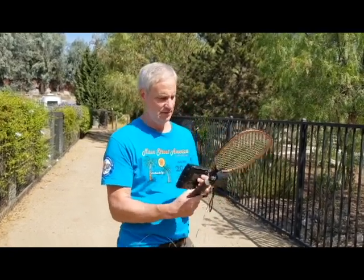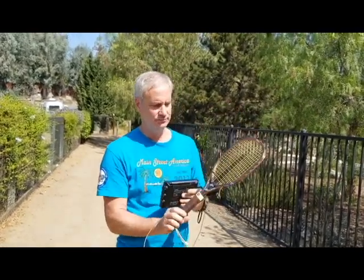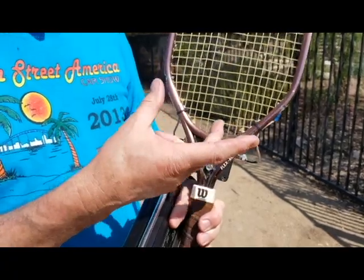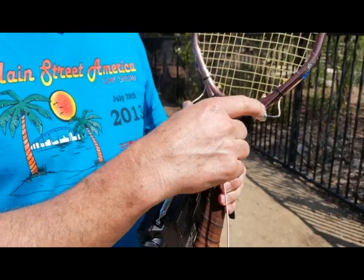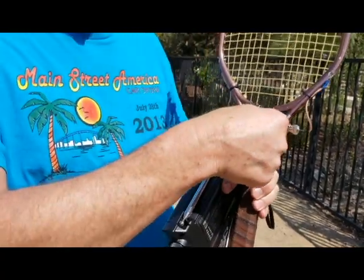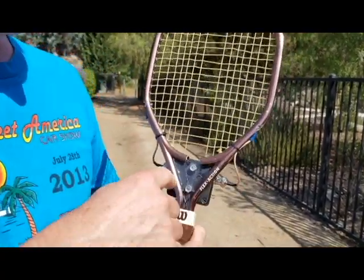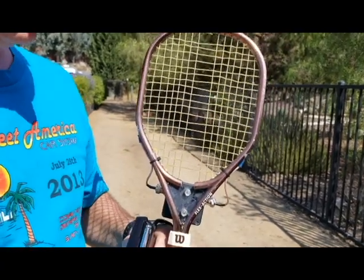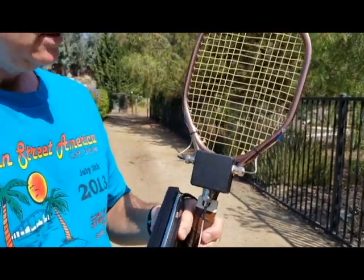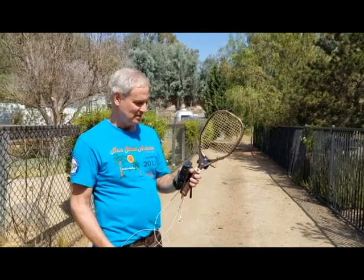You could use a wood racquetball racket and just put a wire around it, but Randy actually used a metal one and cut a section out at the very bottom — because otherwise it would have been a complete, short-circuited loop. You actually want the amplifier to be put in the path of the loop. The two ends don't touch each other in the handle. This was a racquetball racket he no longer uses, so he repurposed it — now it's an RFI detector antenna.